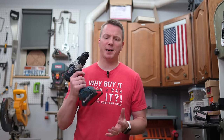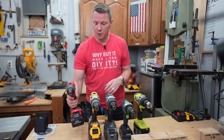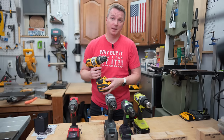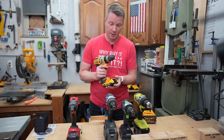I do have to acknowledge that a lot of times when you're buying a big beefy drill, you don't care that much about the clutch — you're not doing a lot of sensitive work with it. You might use a smaller 12-volt drill for that. I just wanted to put this to rest and find out how much the clutch performance is impacted by the battery and by the gear. Now for the next two rounds, we're going to swap out these big batteries and put some much smaller batteries in each of the drills, and go through first gear and second gear again.